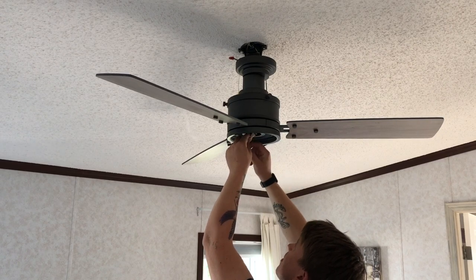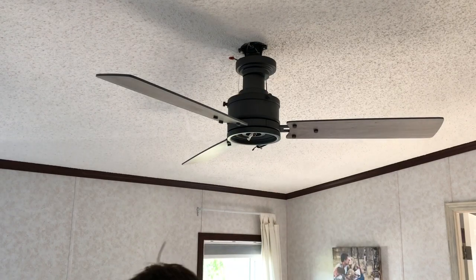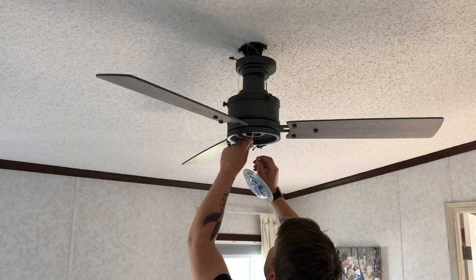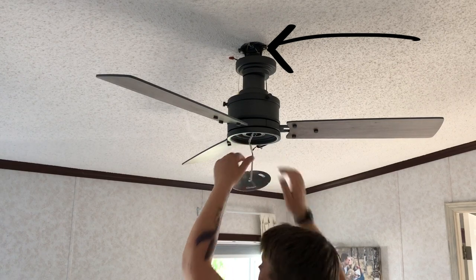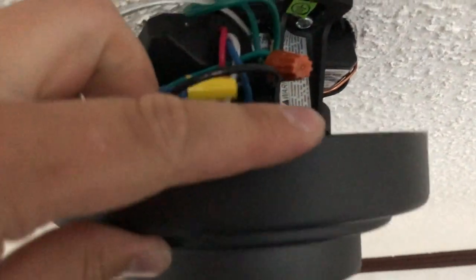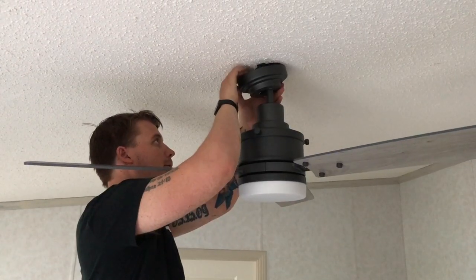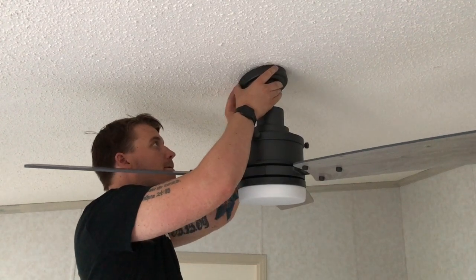You also need to take the receiver box for the remote — it's attached to the fan and wired in. The instructions are clear, but you need to be able to put that receiver above your hanger bracket, so you don't want to attach everything up before it is in place. You'll see it's the box we're sliding in up above the fan itself. Once you lift your hanger ball into the hanger bracket and lock it in place with the tab and slot, you're good to attach all your wires and get it working. We made sure to get everything working — including the light, the fan, and the remote — before we attached the plate to the ceiling, so we could get in there and make any adjustments if needed.